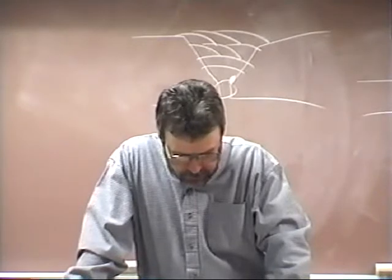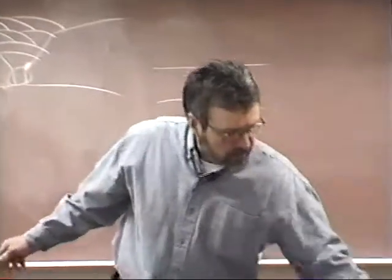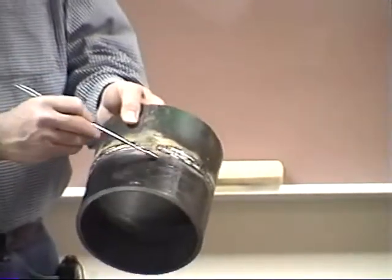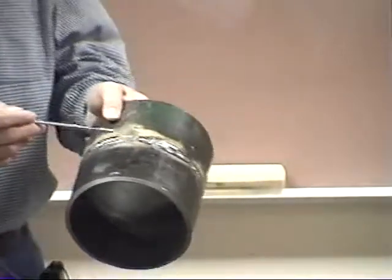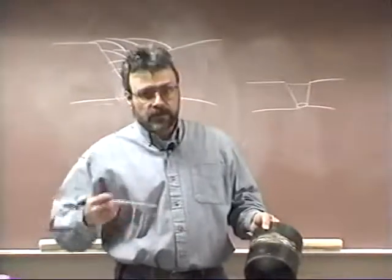Dropping down to the last paragraph there, it says an allowance should be made for the same procedure, staggering the stringer beads on all filler passes or when depositing stringers for capping. Just like in any of the other pipe welding courses that we've done, you want to stagger your starts and stops as you're coming around this pipe. Don't start and stop all in the same place. Why? If they x-ray this pipe and you've had all your starts and stops in one spot, the chances of you getting multiple discontinuities, such as slag inclusion, undercut, porosity, lack of fusion, in one small given area increases greatly. So if they x-ray that and you see all of that combined in that small area, it could be enough to reject the weld under x-ray interpretation.